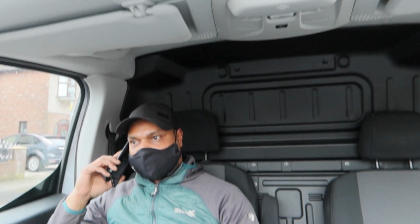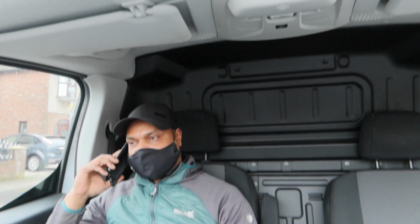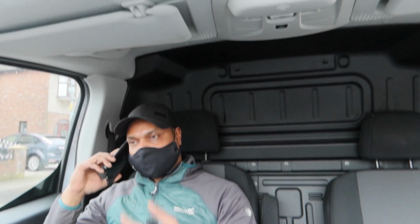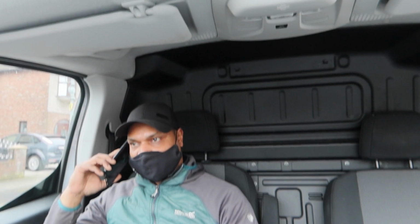Well, I've just had it on. What I did, I've opened up the switch and took it out, and I thought it could be a loose connection somewhere, but all the connections are sound. When I turned it on, I left it on for a few minutes. When it does come on, it stays on for about 5 minutes. But it's the switch that's playing up. Sometimes it doesn't fully click on, so after a few seconds it just clicks back off. So that's why it's going off.